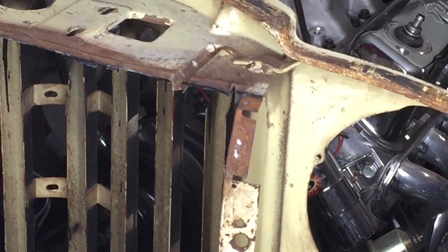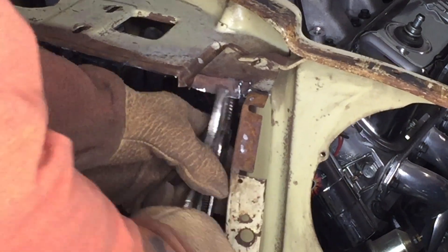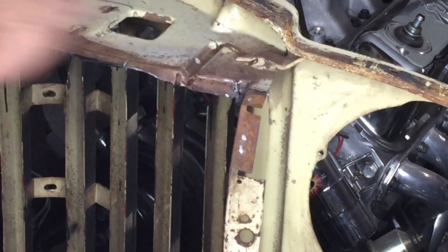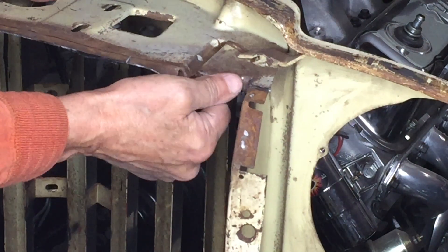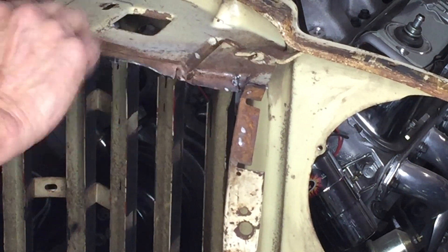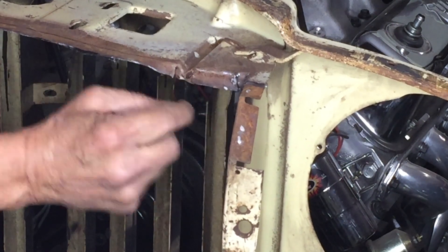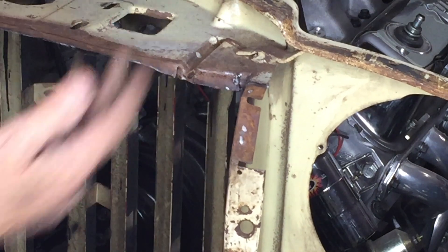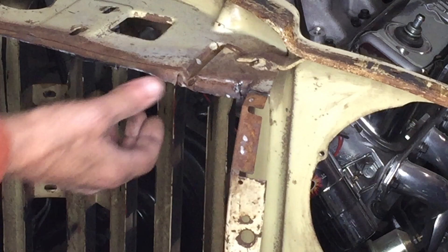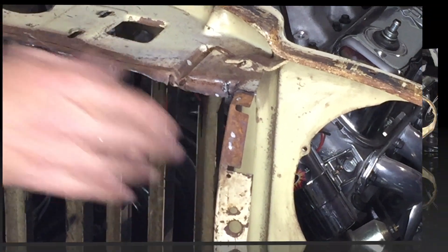All right, I've made a mark across here where I want to fold it. It's turning out pretty nice, so with a little time and effort and gradual finesse I should be able to make a really nice clean bend. It looks like I'm going to be able to just smash that radius all together right there and then tack weld it - could clean up really nicely. I'll just keep working my way across gradually and slowly so I don't stress it or crack it.